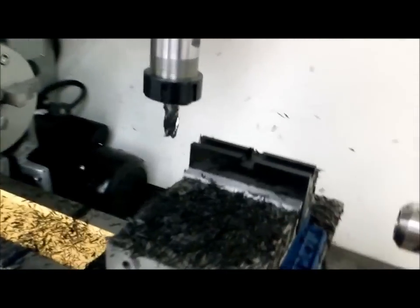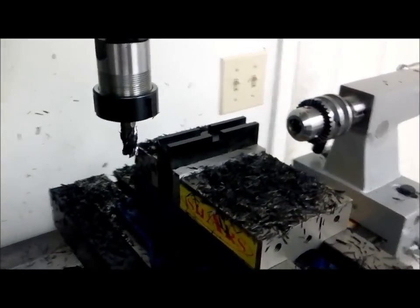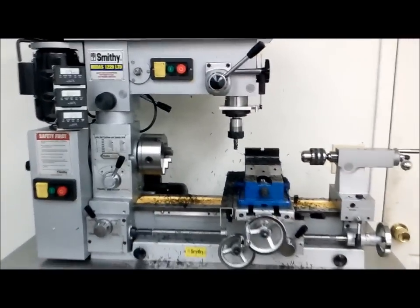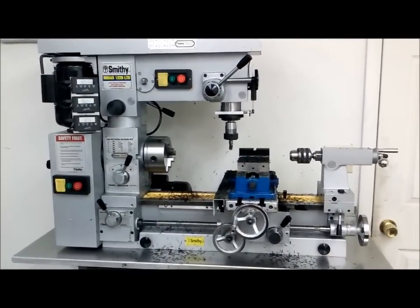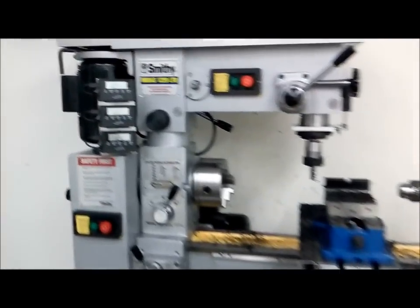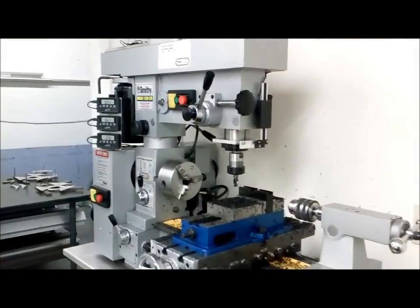For polyethylene, the machine is outstanding. I've played around with aluminum and mild steel — obviously you've got to take smaller passes, but all in all the machine works really well and I'm quite pleased with it. The DRO, in my opinion, is an essential piece of hardware for this machine. For $108 on eBay, it really makes the machine. Anyway, hope you enjoyed our little demo. Have a great day.